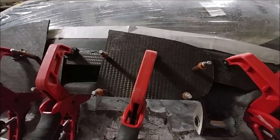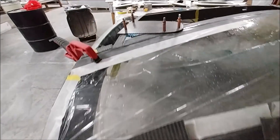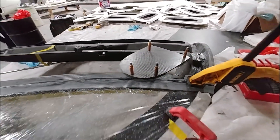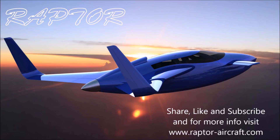On Saturday I ran the engine with the other injector profile that Motec had added to their software, but it wasn't really good for our application — it didn't run the engine well at all. So I'm going to stick with the profile we have now and maybe tune it more later. The engine is running pretty good. The next thing is to get more temperature sensors in there to see exactly what the temps are on the exhaust. Anyway, that's the update for the first half of this week — thanks for watching.